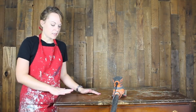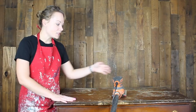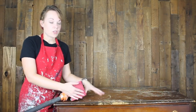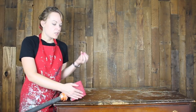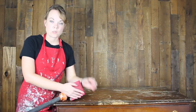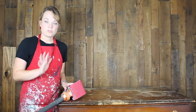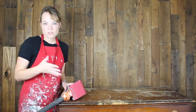It is very scratched up so the finish should come off pretty easily. I'm going to use my pad sander — I like to use a quarter pad sander — and I start with 120 grit sandpaper. If you have a solid piece of wood and you think it's going to be harder to get through, start with your 80 grit. Just be careful if you're using 80 grit that you don't have a veneer top. A veneer is a really thin piece of wood, less than a quarter of an inch, and you can usually look at the very edge of your piece — if you notice a thin strip of wood you might have a veneer. You don't want to use 80 grit on a veneer because you can really quickly sand through it.